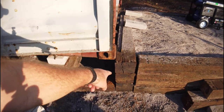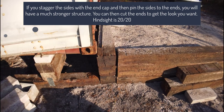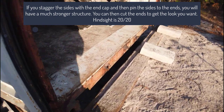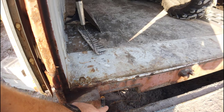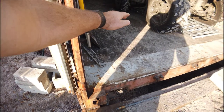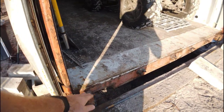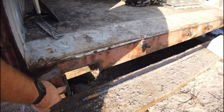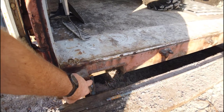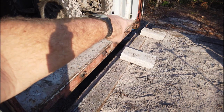The next thing is doing the same type of pinning here — there's a lot of force pushing toward the trailer. What I decided to do was cut pieces of rebar two feet longer than the height needed to hold this up, drive that rebar down into the ground to the right height, then position it and tack weld it. I did make a mistake and got the tip stuck so I had to back off — didn't have more tips — so I had to leave this with just the tack weld, but it actually held.